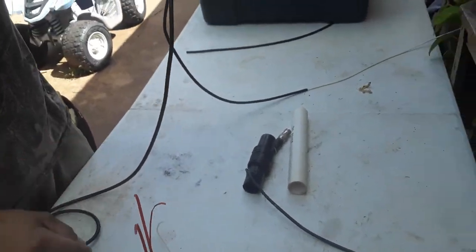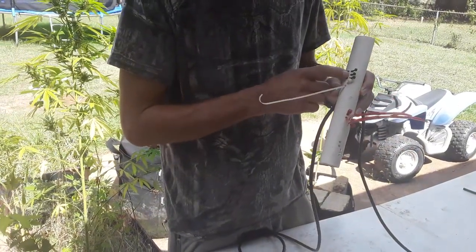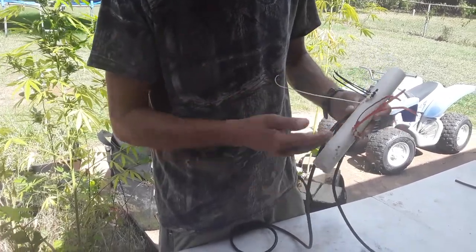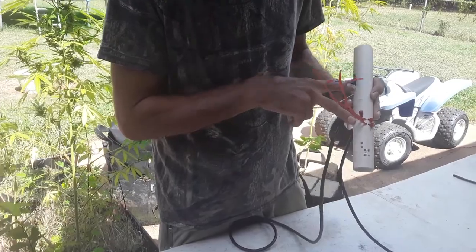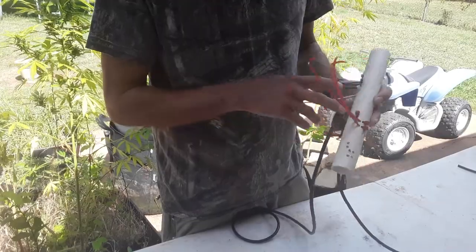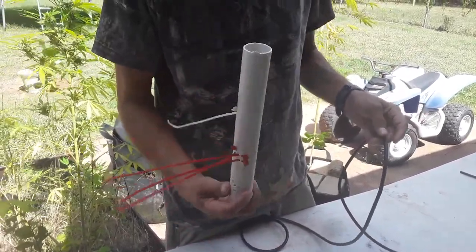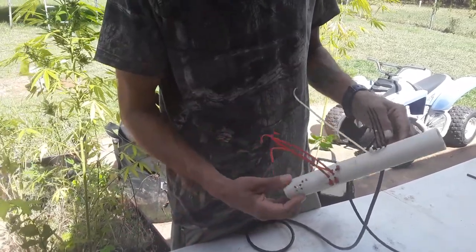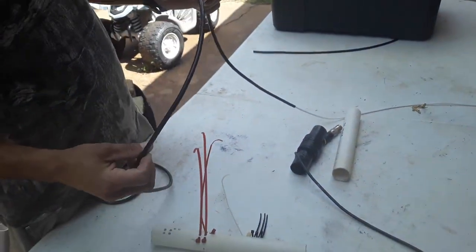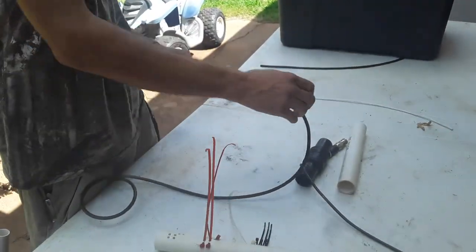Now what I did was I pre-drilled the top here and I added some coax — there are some zip ties also. That's going to be the top of our coil. I didn't measure this out, but it's going to be nine turns. Whatever former you're using, it may vary by a millimeter or two. I've seen some of these 25 millimeters, I've heard some being 27. So I think it's actually about 27 OD. I can't tell you exactly how much to mark out for your coil, but normally when I'm making these, I make them just the antenna only.